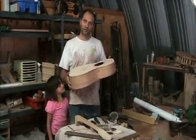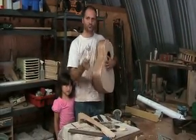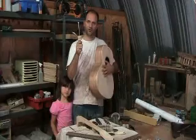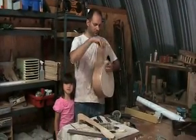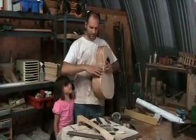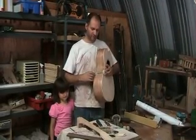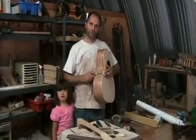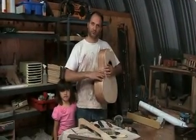And on this guitar, we did the top, we secured the top to the rim with rubber bands in the mold. And then the way I've come to do it on the back is I have these spool clamps that I've made out of large dowel and carriage bolts. I put it on the side of the guitar like this and clamp it down, and then I have a series of these around the body, and that seems to give me more uniform clamping pressure and a better attachment to the rim.